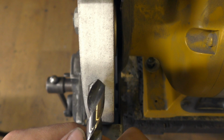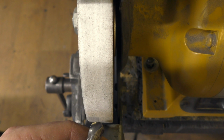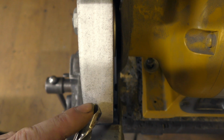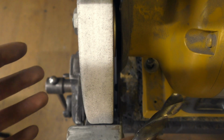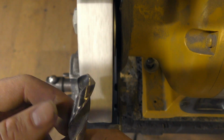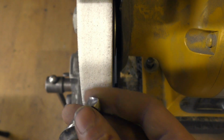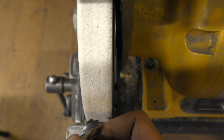You can also get smaller grinding wheels as well. So this is our drill bit. As you can see, it's relatively dull. What we're going to do is start off by grinding each side, and we're always going to grind the left side. A lot of this comes from feel, and the best way to learn is to go down to something like a swap meet or garage sale and buy a box of drill bits that are already pre-dulled for your convenience, and just go to town sharpening them. There's no teacher like repetition.